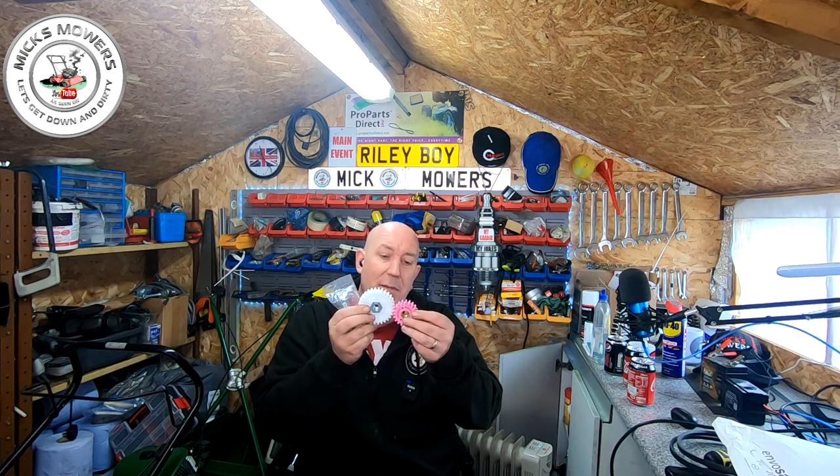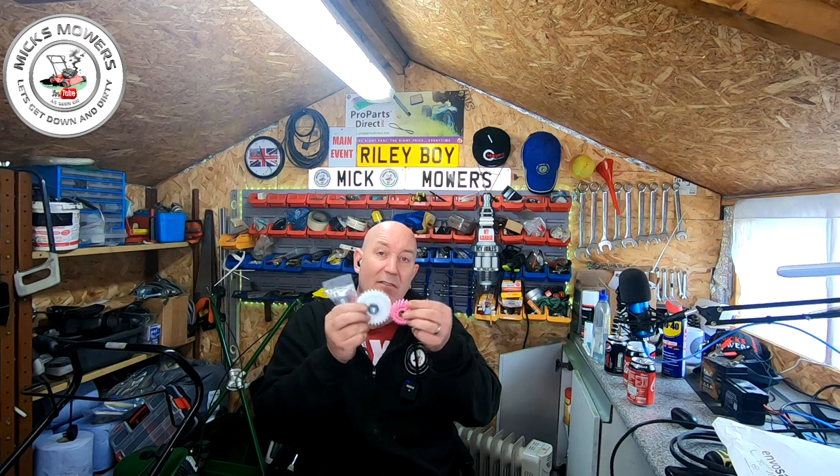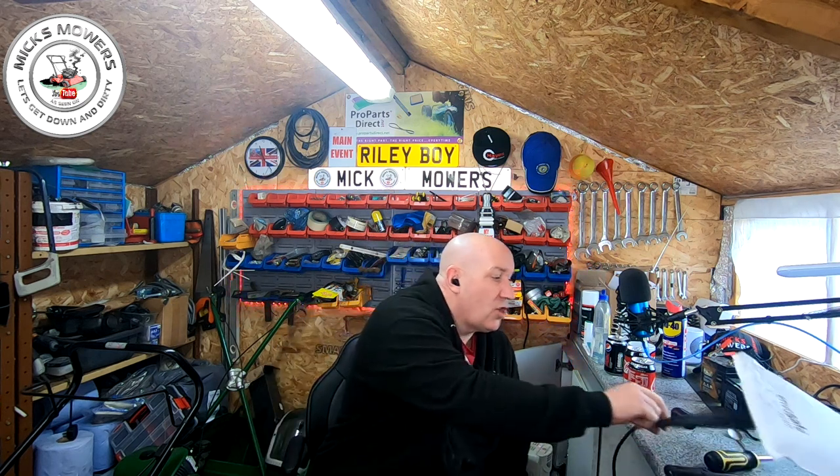On the white gear on the cylinder and the intermediate gear I noticed there's a bit of a gap between them and they may be striking rather than actually running alongside. Today I'm going to show how to change the pinion gear, the cylinder gear, both intermediates, and also fit a new set of belts for good measure. I've ordered another battery because the current one doesn't have enough throw to engage the starter.